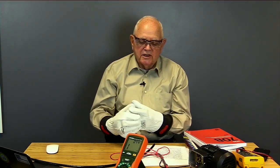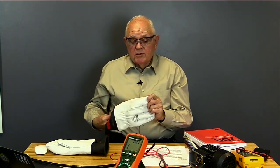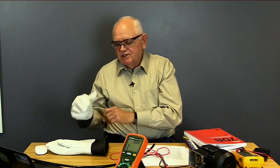I'll go over to A phase. Push it. There's our 500 volts. And it went to 497 mega ohms or something. I couldn't tell, couldn't catch it. And then it's back to infinity again. So when that meter bounces around, you can really see it on an analog meter. I'm looking at capacitive charging current and dielectric absorption. Now, oh, by the way, my meter did go back to 0.